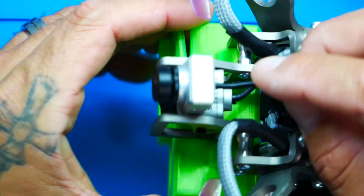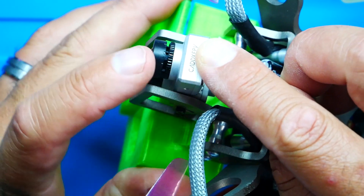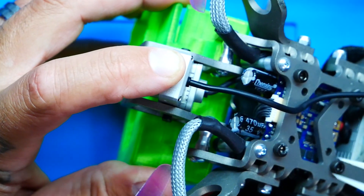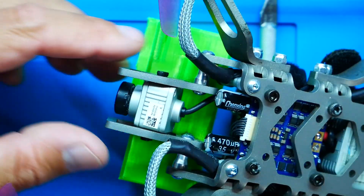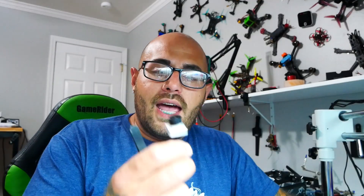Let's look at the actual thickness of the camera. If I line them up from the front of the camera — the neck, the lens, the adjustable ring — everything is 100% identical. The only difference on this camera is you have a single screw hole for mounting, and you're losing about a third of the actual thickness of the camera. One thing I want to mention: when you receive your DJI Air Unit camera, you have an arrow on the back letting you know which way is up. You don't have that on this camera, but you can jump in your goggles, press flip the image, and boom — you're back in action.